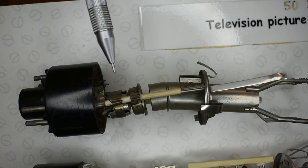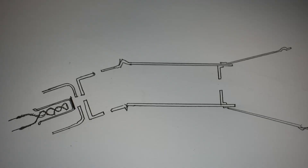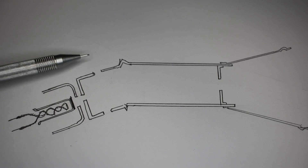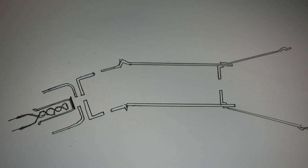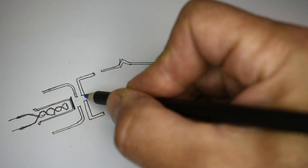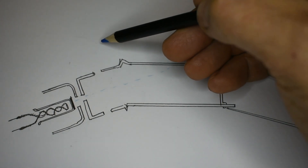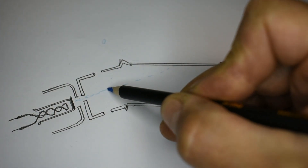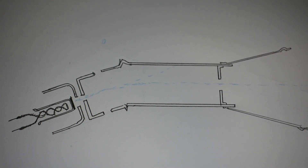The bend was to catch ions heading towards the phosphor, which would damage the early screens. We have the cathode and heater in this section, then this cylinder forms the grid, then the first anode, and the final accelerating anode. Electrons coming out would normally go in a straight line and hit the anode wall — this is intentional. A small magnet placed on the neck of the tube would cause the electrons to turn slightly so they emerged from the window in the anode and hit the screen.